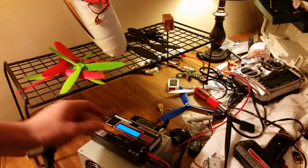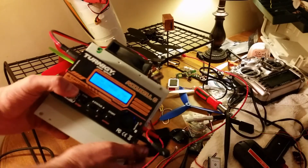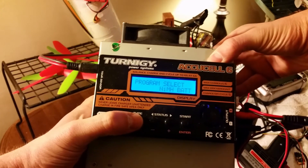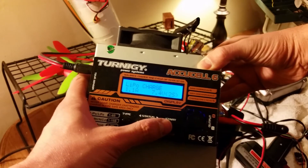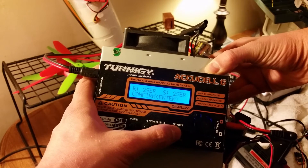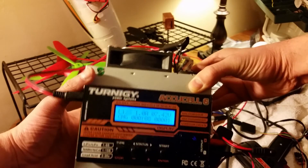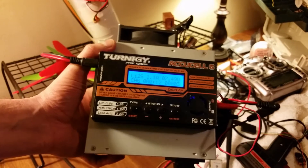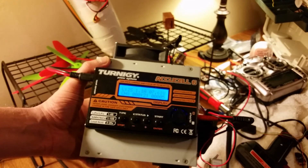Go on over to the 3 volt mark. Here we go. I should have set it for under 1,000 milliamps because it's a fat short battery or whatever. It's not going to kill it. That's how I do it — charging a dead LiPo so you don't throw it away and buy a new one.